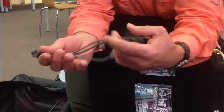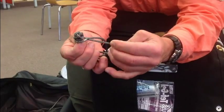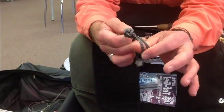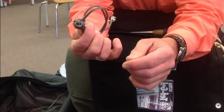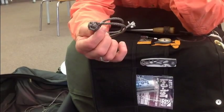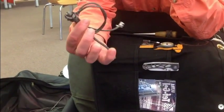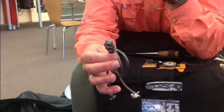Yeah. I think there's some tricks we can do to make them break close to that. Theoretically, we should be able to get as much as 400%, because you've got two parts here and two parts there. Now, I'm sure we'll never reach 400, but I bet we can break 300. So this little shackle then has a breaking strength of about 3 tons. This is 1/8-inch Spectra. Wow. 1/8-inch Spectra. Yeah, incredible, isn't it?